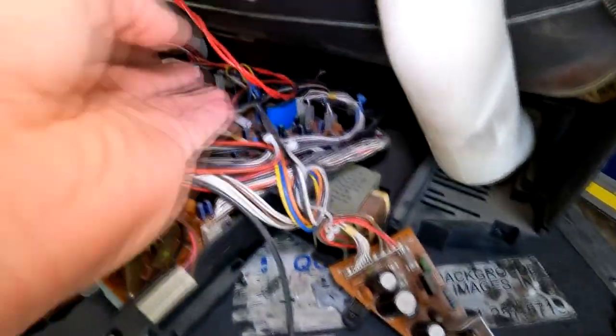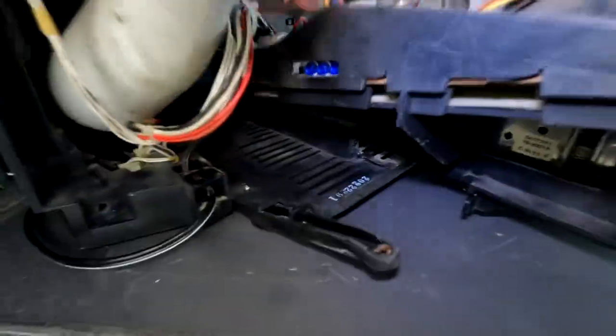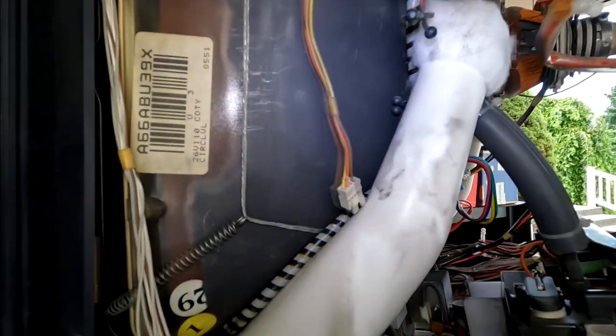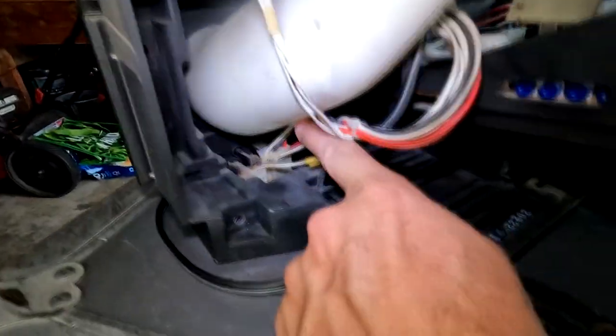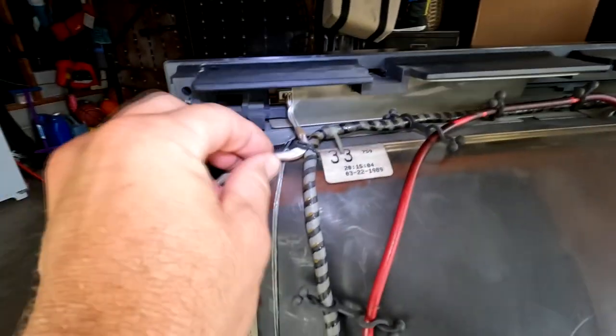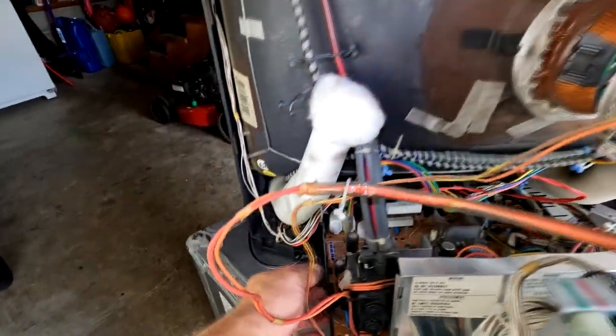And then I'm going to disconnect the cables down here for the degaussing coil. And then I've disconnected the yoke, deflection yoke cable right here. And then let's see, this cable was actually tucked around under behind the speaker tube and connected right down in there, so I'll reconnect that later. But I have to make sure I disconnect all these over here that are going into here. And then it looks like there's one more. Yep, that's coming up and disconnecting here. So I need to disconnect this cable, all these, because those connect around to the front side and then into all this.